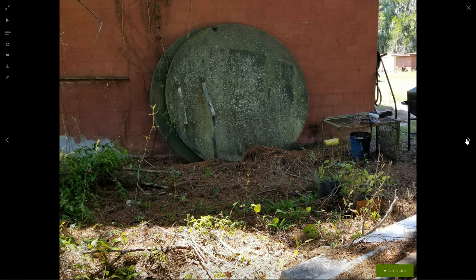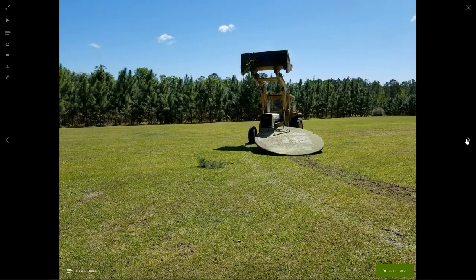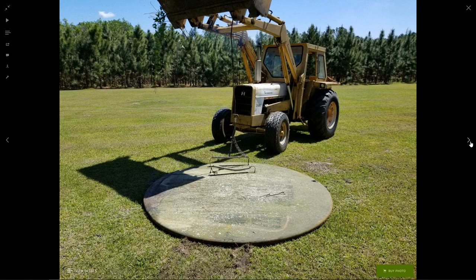This is going to be a video showing pictures and commentary on how I built the first one, and then you'll see another video of me starting the second one. The second one was a lot worse off material-wise than the first. So this was my dad with the front loader basically dragging the plate around back to the front of the shop where we can work on it. You can see it laid out — it's eight feet in diameter, quarter-inch thick, and the edge is actually double-walled, so it's like half-inch thick around the outside edge.